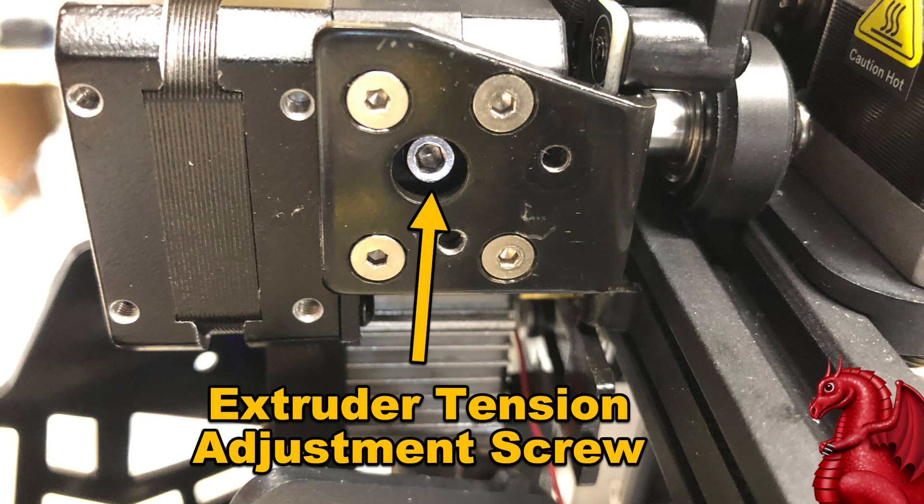So that's what I'm going to show you here — how to get the Sprite extruder off your machine, how to open it up, and take a look inside. In my case the screw and the nut came apart and detached from each other. You could also have filament shavings in there that need to be cleaned out once in a while.